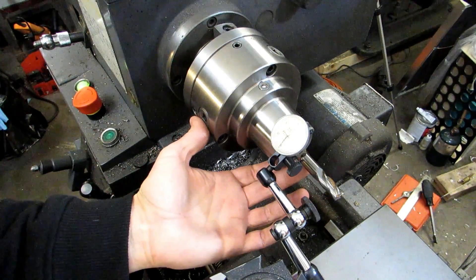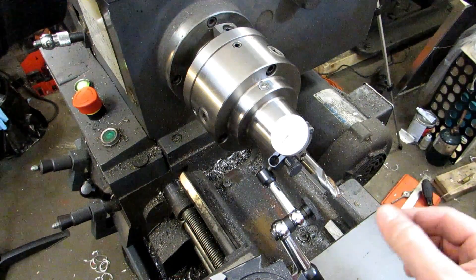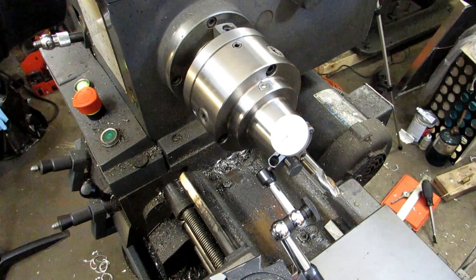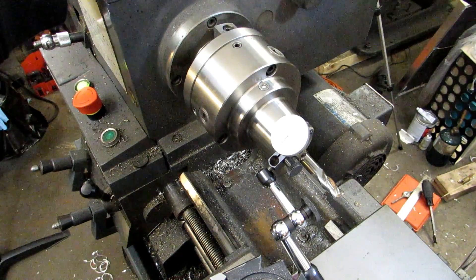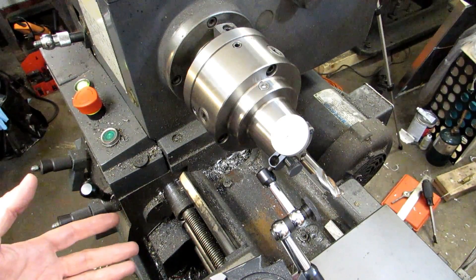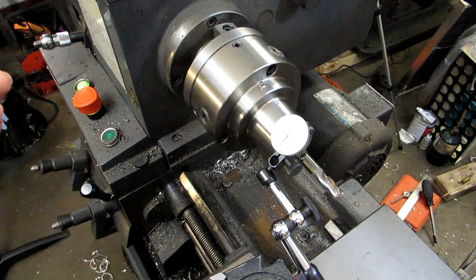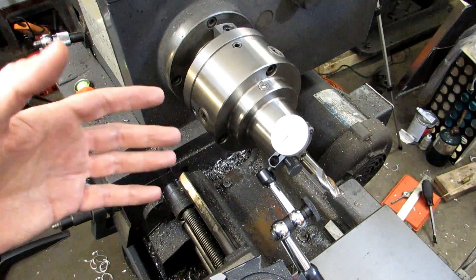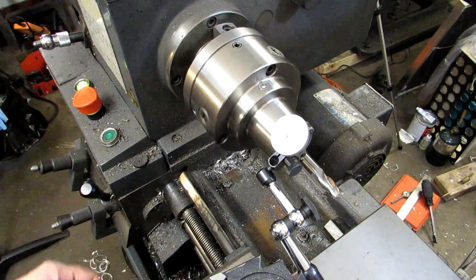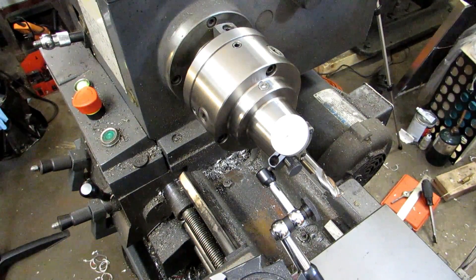I indicated about a half inch from the collet because that's where I do most of my work. Some people advocate having a rod that sticks way out and indicating four or five inches out from the chuck, but I don't find that handy because I'm never doing work there - I'll indicate in where I do most of my work. If you were doing this with a three-jaw or six-jaw adjust-true chuck, you should get really good concentricity at the diameter you dialed in, because that's where it's going to be clamping on the scroll. At other diameters you might have poor concentricity, in which case just put in a part of that diameter and dial it in there. I hope this helps - thanks for watching and I'll see you next time.